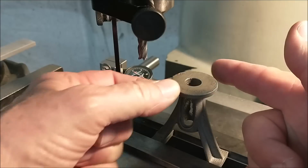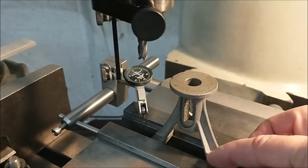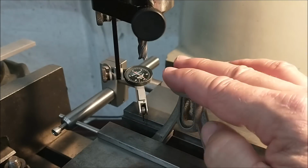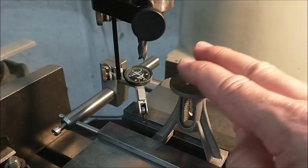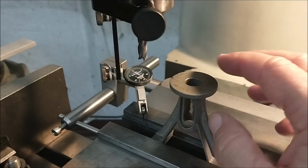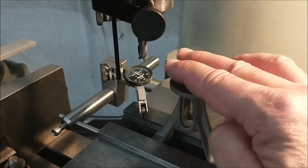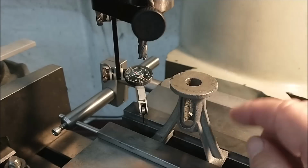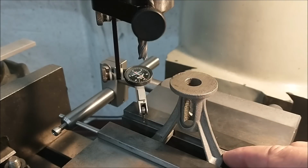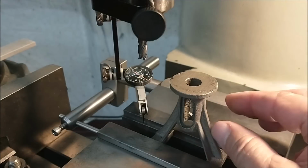I'm going to actually tap the part. That is going to bring the top diameter true to the feet. I'm going to deck it off. Once it's decked off, it's going to be flip-flop, flip-flop. It's going to be 1-2, 1-2 machining like you've seen me do in the past. So once this is parallel, once this is flat, I will then bank on this and cut the bottoms of the feet again to make the whole stack parallel. All right, let's get to it.